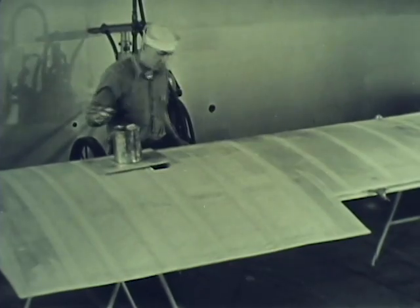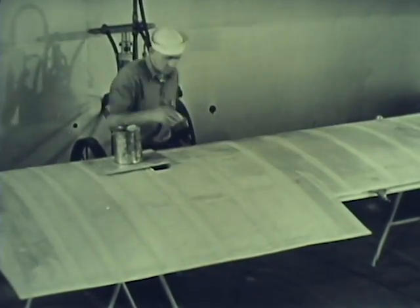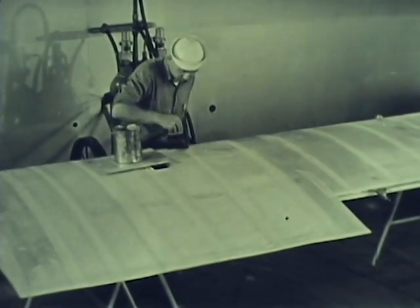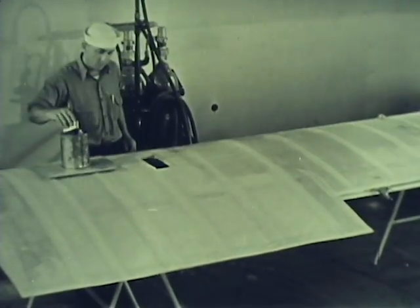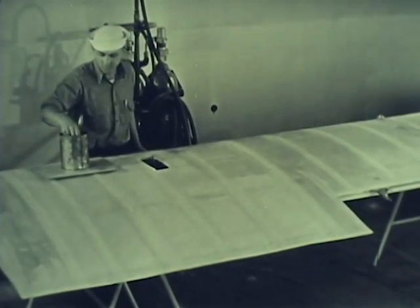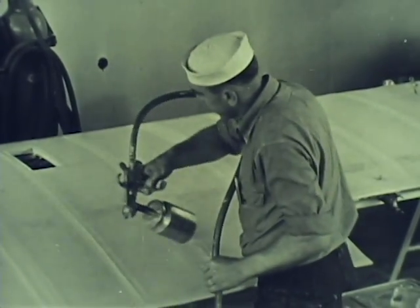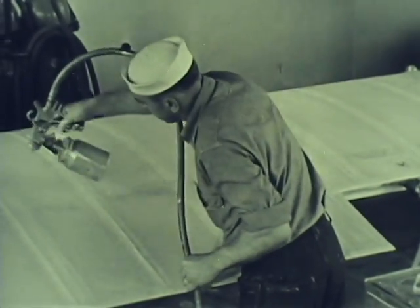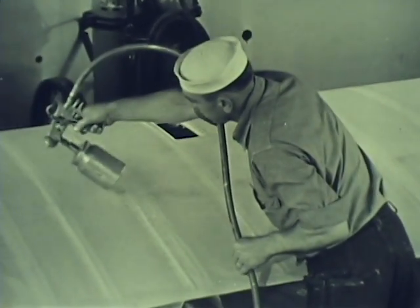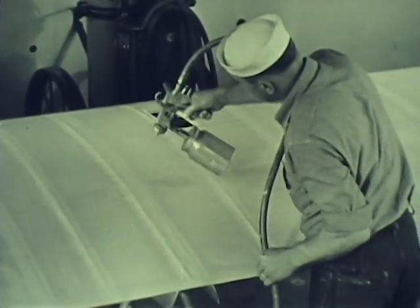The entire finish can be applied with a brush. However, the brushed coats are used mainly to tighten and set the nap of the fabric. After this is done, it is quicker and easier to apply the remaining coats with a spray gun. If dust has settled on the dry surface, it must be removed before spraying. By depressing the spray gun trigger halfway to release air only, the dust can be blown off the surface.